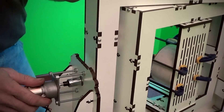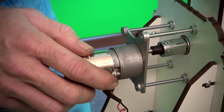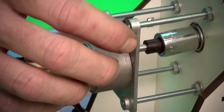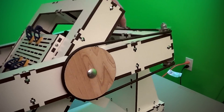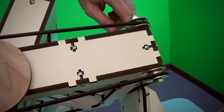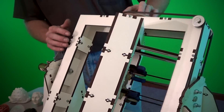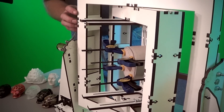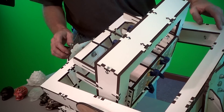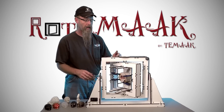It uses a 12-volt gear motor on the side that directly drives the major axis. Along with that, it runs off an o-ring belt that walks around and turns the minor axis. You only have one motor to worry about. We're doing a three-to-one gear ratio from major to minor axis to allow full coating, as it's completely random when it turns.